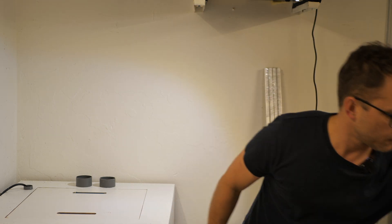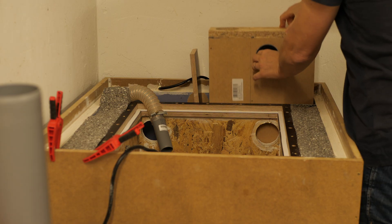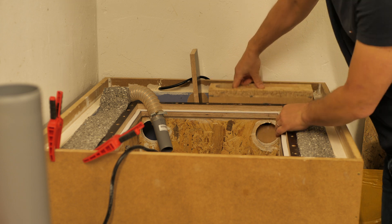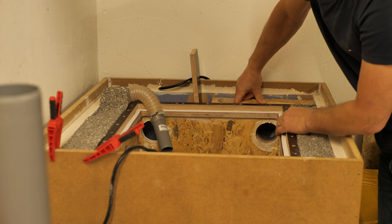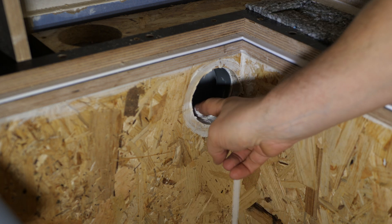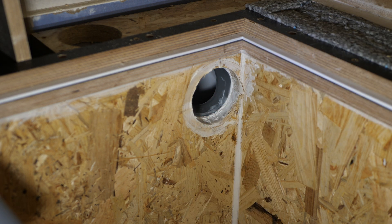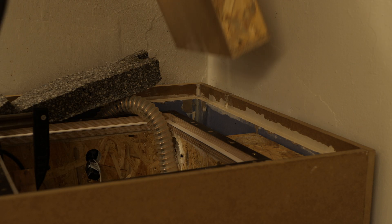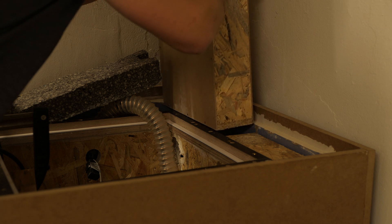At the end of the day, I found out that the old maze design for the exhaust duct is a perfect compromise and a perfect solution for me. And here's another thing I would definitely change next time: I designed it for the lightweight PVC duct. These maze boxes need more space and they are hardly decoupled from the back wall. I would design it with more space so that I can decouple it with another layer of absorber material.